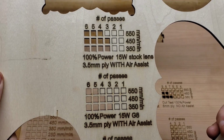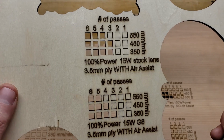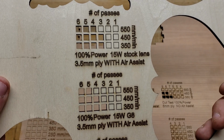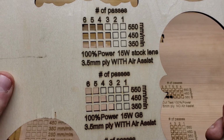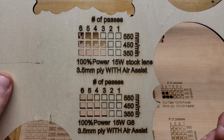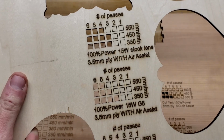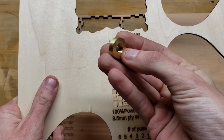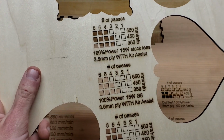I never tried it really at the 30 millimeter focal length, at least not much, because you have to back it away beyond the engagement of that O-ring. So you either have to slather some Teflon on it to hold it in place to keep it focused at 30 millimeters, or you just lock it in place with one of my nice brass lock rings.